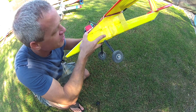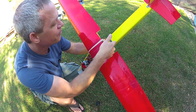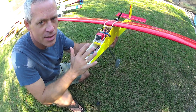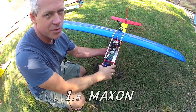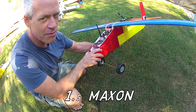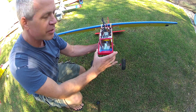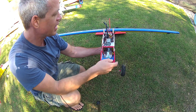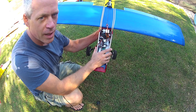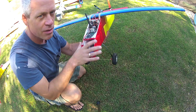Landing gear are optional. I've used rubber bands to fix my wing, but there are many different ways to do that. The pusher motor, although being a little bit less efficient and noisier, it's much safer and not likely to damage it on impact. Here's a version of the Axon I call the Maxon. It's scaled up in every dimension about 50 percent, so it's got a larger cord, longer fuselage, a three-inch instead of a two-inch tubular fuselage, upper and lower decks. This is meant to carry a GoPro in the front and all the OSD and long-range receiver gear, GPS and so forth. Put beefier landing gear, and it does quite well.